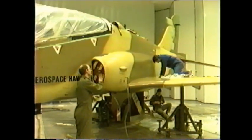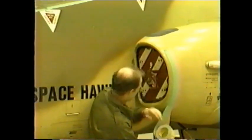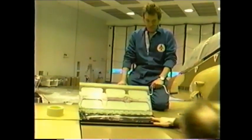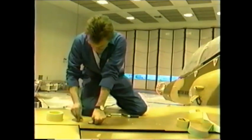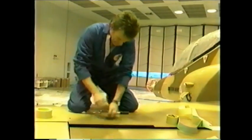The aircraft was prepared by masking all the intakes with the aircraft jacked up, gear up, flaps up, and all the controls in a neutral configuration. To prevent media ingress, existing blanks were used where possible. Areas such as flap shrouds were opened and then internally bagged, closed, and then sealed with blast tape.